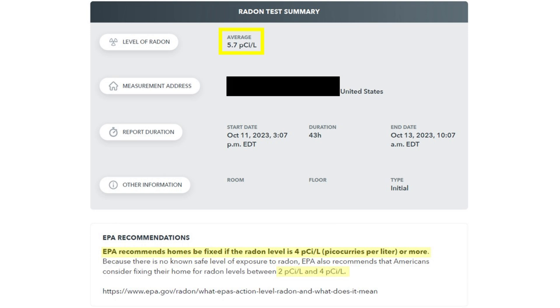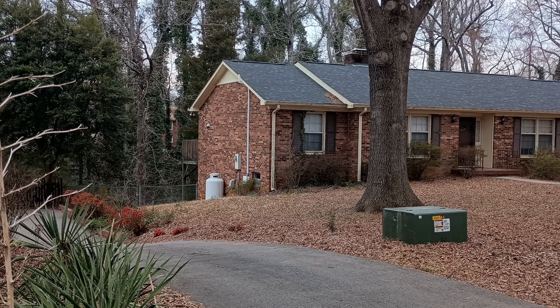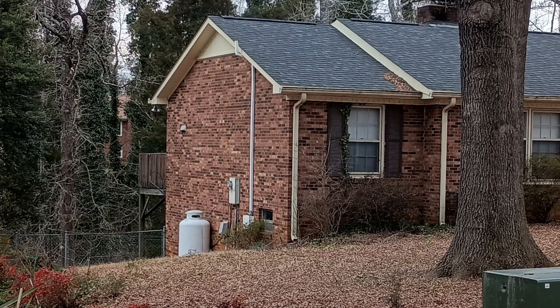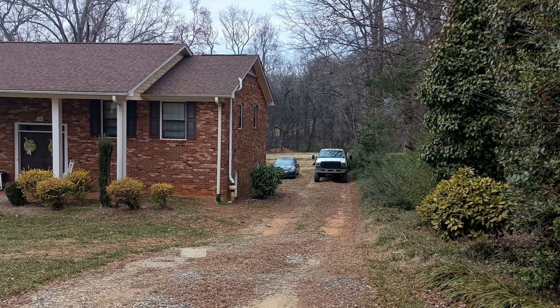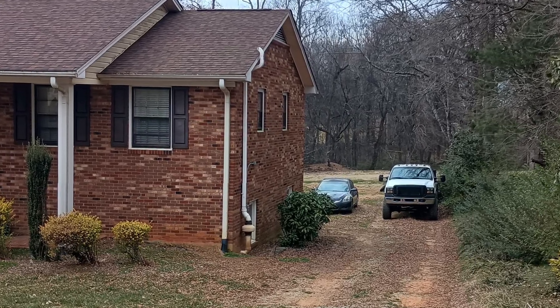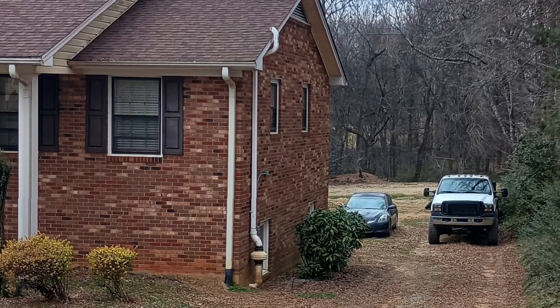Plus, sometimes I've seen the one-day average number get pretty high, like around 15. I got a couple quotes for a system to be installed and they're around $2,000 in December 2023. With a professional installation, they usually core into your concrete floor, come up and core through your foundation, put the fan outside, and then run the vent pipe up the side of your house. I don't like the way this looks and I don't like paying people to do something that I can do, so I decided to do the mitigation myself and route it inside my home.